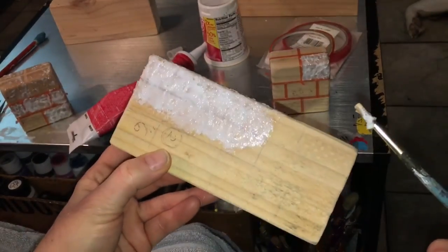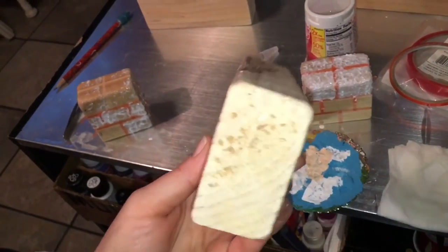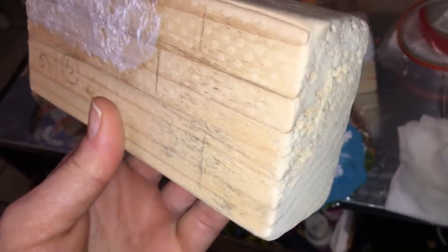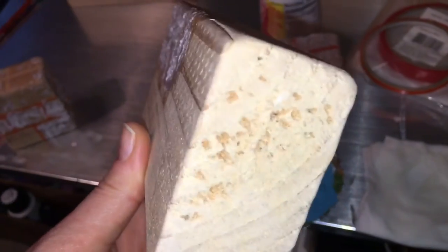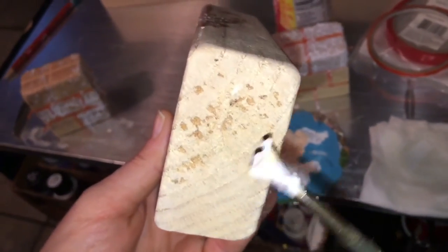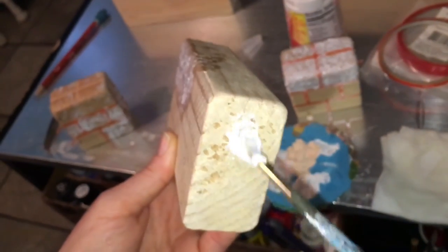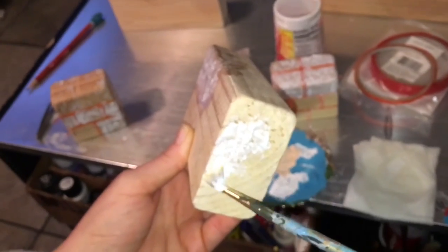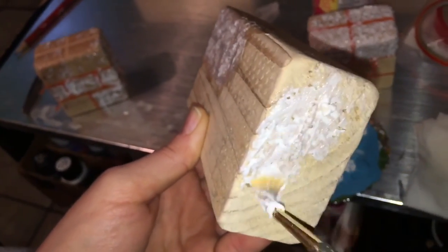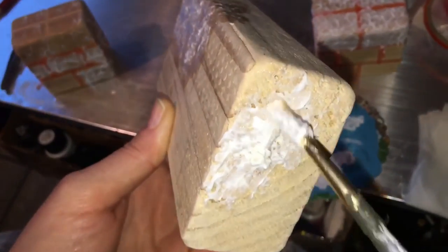Now another reason this is helpful on wood — see how ugly that is? That's all pitted and just the way wood sometimes does. You'd have a hard time making just paint look like stone on that. So this is where caulking comes in great, because you can fill all that in — do it thick because it will sink — and you're going to make those things disappear and use your caulking to camouflage it.